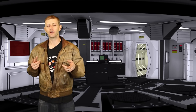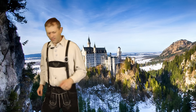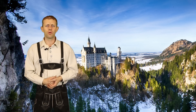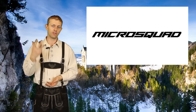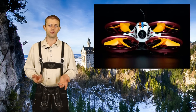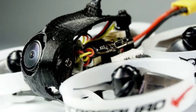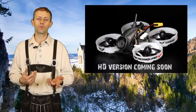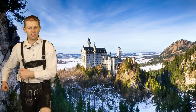No spaceship is complete without a holodeck — let's take a trip. We stopped over in Germany to check out Micro Squad. They make micro quads in 75mm and 65mm brushed and brushless configurations, including the Black Mamba 75: a 2-to-3S micro drone with an F4 processor, all-in-one 8-amp ESC, and 1103 11,000 KV motors.